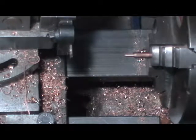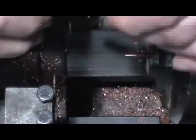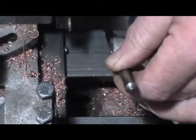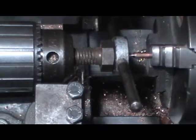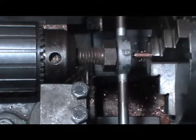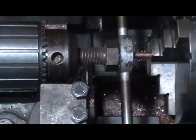So I've turned it down to its outside diameter — 0.110. I'm just going to put the thread on now, but I'm having to do this manually with my die holder. I'm doing these with no lubrication because I don't want to contaminate the silver soldering.